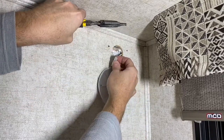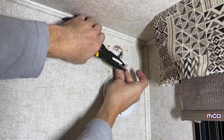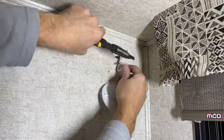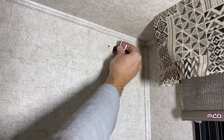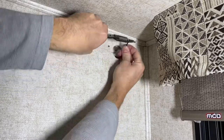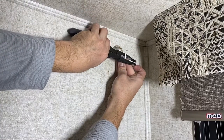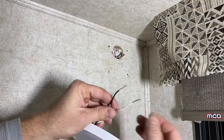Not a big deal. I turned my power switch off, so we don't have power here — we're safe to cut these wires and strip them. Looks like these are 12-gauge wire coming in. I stripped these back a little bit so I have more wire to work with.